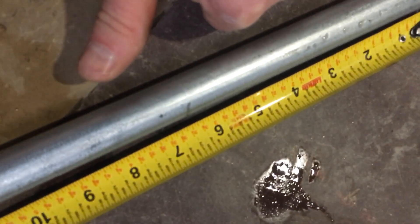All right, second bend. What you do is you make a mark on the end — I use my finger like that. Say six inches, depends. You can always cut it — that's why I always bring the saw up wherever you're working. All right, that's your six-inch mark on the end. Put your bender on it, always using an arrow, put your foot behind it, put it on your mark, which is on your arrow. Roughly six inches.